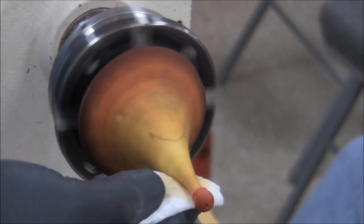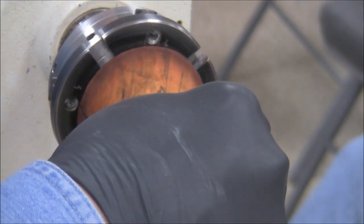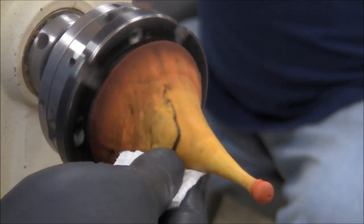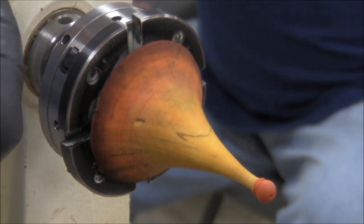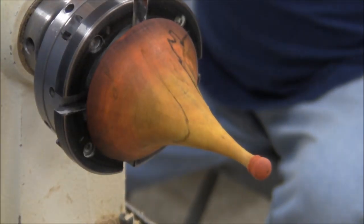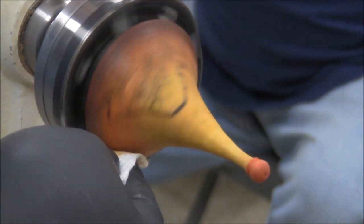Shellac, did you buy pre-mixed shellac or did you mix it? This is Mylands friction finish. I also have pre-mixed shellac. I've never bothered to get the flake myself. When I first started making flutes, I was using shellac as a finish. And then I realized, son of a gun, it uses alcohol as a solvent. And if somebody is taking their flute with them to a bar, it's not going to look pretty when they leave. So I shifted over to a polyurethane finish on all my flutes.